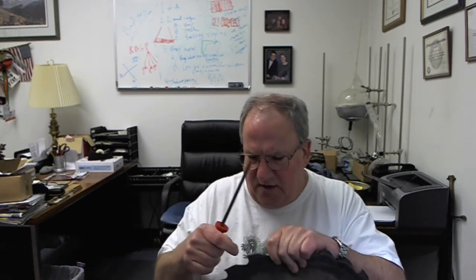However, when you do as I just did — and this is a plate that's never going to be run — what you've done with the sharp triangular edge is created a notch, which is a stress concentration point. It's a discontinuity in a smooth curve, and just as we said earlier, this is where the trouble's going to start. This is an invitation to a crack or a tear in the steel. So the round file is, if you're going to run the saw, far and away preferred. I would not use the triangular one on a saw blade that's ever going to be run.